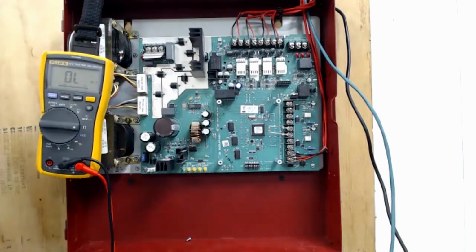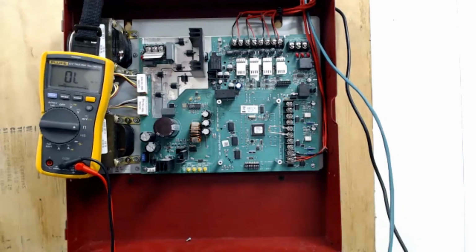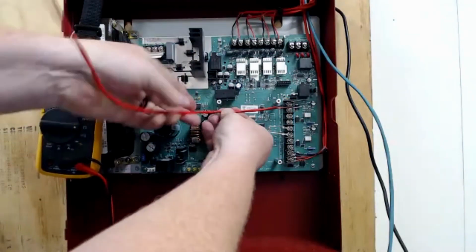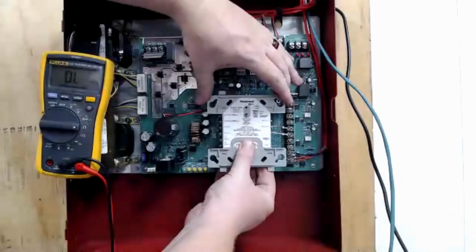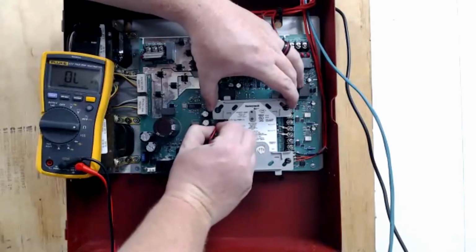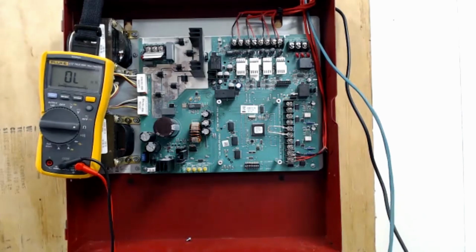Now I'm going to have to make a couple of jumpers here, so y'all have to bear with me while I strip some more wire. This wire that I'm stripping back right now, I'm going to use as my auxiliary power over to my external power in on my control module. Also, if you have a water flow bell that you're powering off of an auxiliary circuit and then switching through a water flow device or an addressable relay, it would land on these same terminals that I'm about to land this wire on. So these are going to land up here and come over, and I'm going to bend it here. Take this and slip it into these terminals. I'm going to hold this here because those are the standoff posts that this is going to mount to. Right there where my thumb is tells me that's about the length of wire I'm going to need.